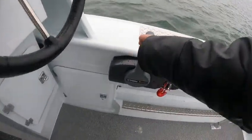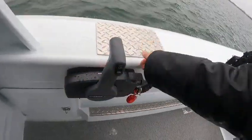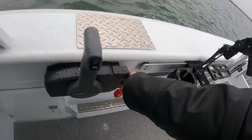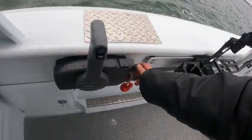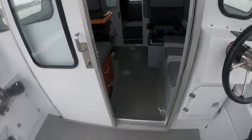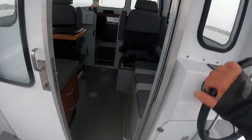So now what I can do is trim this one down, leave this one running. Then just steer where you want it to go. If it's cold, you've got to pump it three times, lift this lever until it stops, and give it a half-inch push and turn. If it's going to die, push in on the key and let go until the RPM comes up. Once it's warm, though, you can just turn the key.